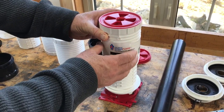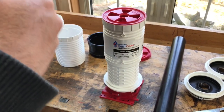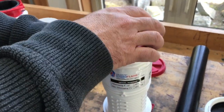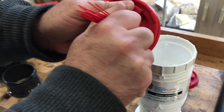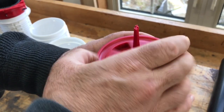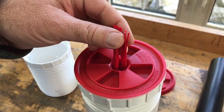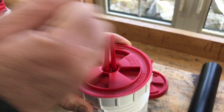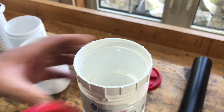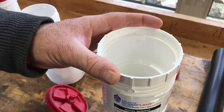It's very easy to pour a little bit too much, so it's conceivable that this sort of sleeve might get covered in concrete a little bit. It's not a big deal structurally, except the people who come back later can't see where the hole is supposed to be, even if it's covered by a quarter of an inch of concrete. This system has these little whisker things that you can activate — you put this in place, put the disposable lid on top, and if the concrete crew does pour a little bit too thick, you still have whiskers up above. You know where to go and bash out the slight excess of concrete, then open it up.